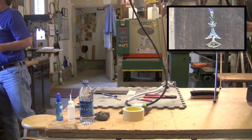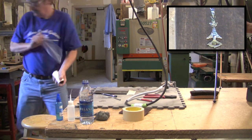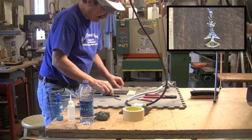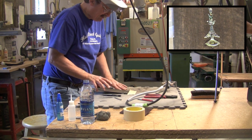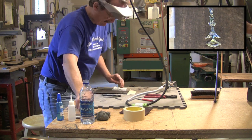Some people would think you'd want to use dust and glue, but I have found that dust and glue leaves a halo. So the trick to this is an invisible fill. I have to put wax paper underneath here because I punched some holes in the ebony. Normally I can lay these on the neck, but this is the fascinating part of this deal.